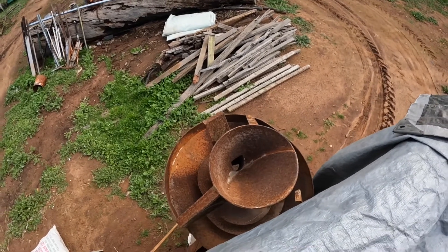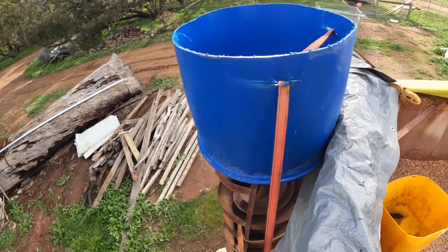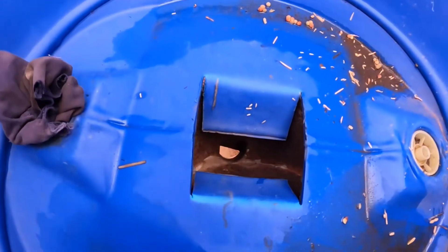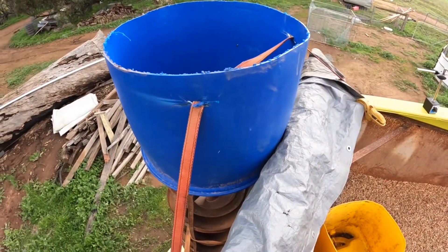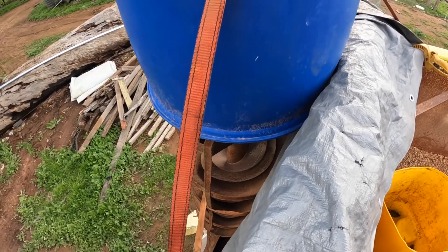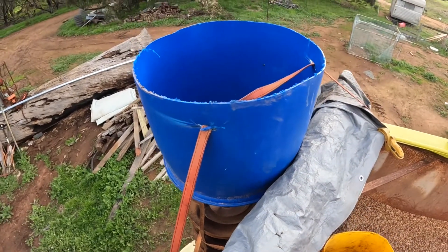This is really a very small hopper, so we're going to put a temporary hopper on there so we can fit a bit more grain in. We've set it up with a hole in the bottom that allows it to run into the small hopper on the gravitator, and the door is set to about half open. The slower you run grain through these, the cleaner it gets — if you run it through too fast it overloads the spirals and the weed seed starts jumping into places it shouldn't be.